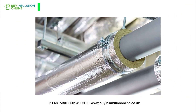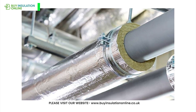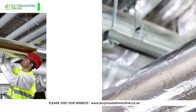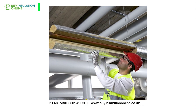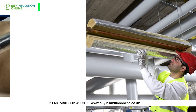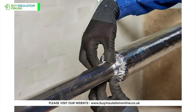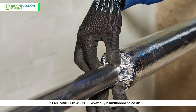Now let's move on to the installation process of rockwool pipe insulation. Thanks to its integral self-adhesive lap, installing this insulation is a breeze. Before you begin, ensure you have the correct sized pipe section. Clean the pipe surface, removing any dirt, dust or oil residue. Measure the length of the pipework and cut the insulation to the appropriate size using a sharp knife. Wrap the foil pipe insulation around the pipe, making sure it fits snugly. Then, remove the backing paper from the self-adhesive lap, and seal both sides together to create a completely sealed joint.